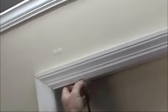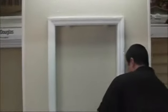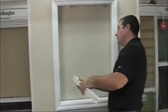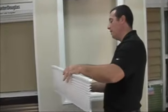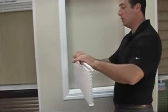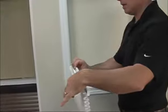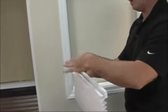Hold the second bracket up, put one screw through the center, and your brackets are in place. Now grab the pleated shade and drop it down just a bit. The reason we do that is so that when we place the shade into the brackets, we don't catch any of the fabric in the brackets — you can pinch the fabric if you don't lower it a bit.